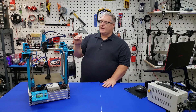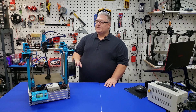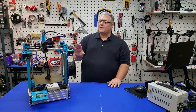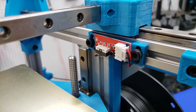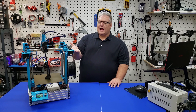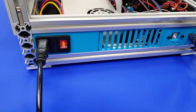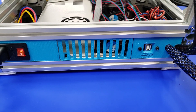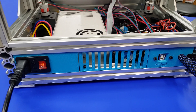We did improve the fan duct a little bit — the non-Volcano nozzle fan duct in the rear here is a little bit improved. The carriage is going to be upgraded in the coming days. The end stop — the mechanical end stop, if you choose to have one on your build — is a little bit thinner, just to accommodate the extra lift from the non-Volcano nozzle. The rear of the printer changed slightly: the power panel needed to be shifted over a little bit, and the fan grille is now just one fan grille given the smaller footprint size, and the USB panel is pretty much the same as before.